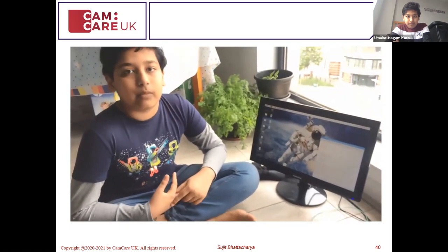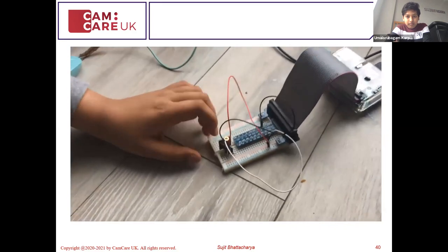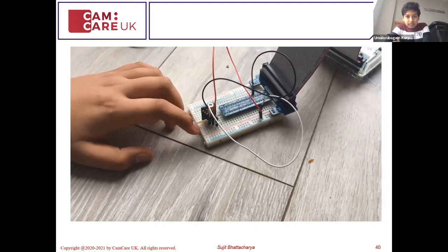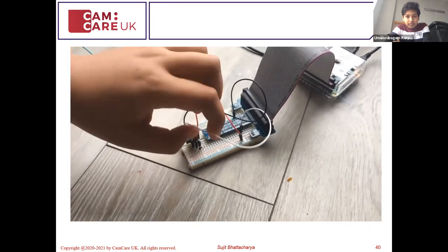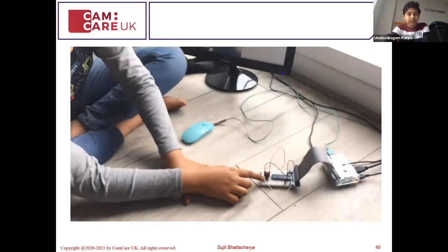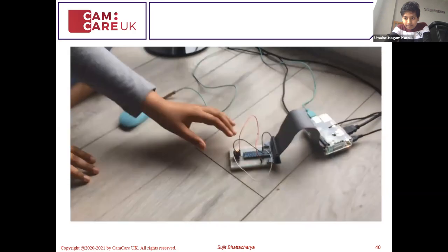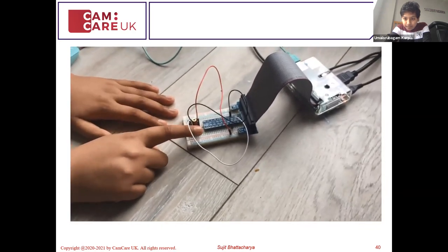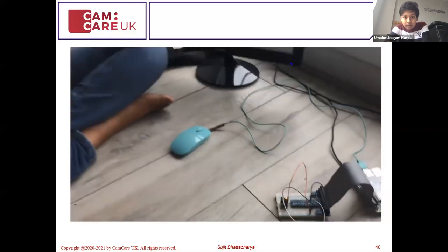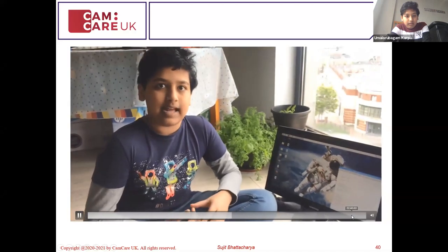First, we are going for the wired connection. The laser emitter is a sensor which emits a laser. The laser emitter has three pins. Number 1 pin is the output, represented by the white wire, which goes to pin number 18. Number 2 is positive. The positive wire is the red wire, which brings electricity for the laser to blink. Number 3 is the negative wire, and it goes to the ground port. In the project, the laser emits a laser every 1 second and blinks 50 times.